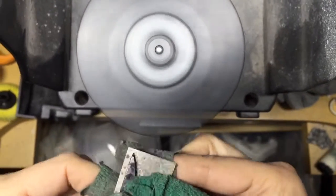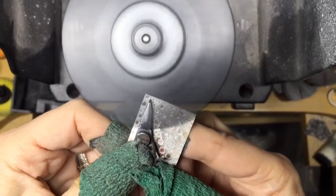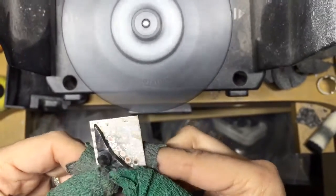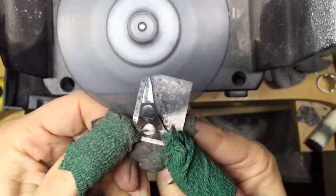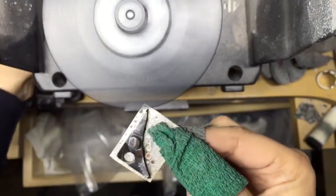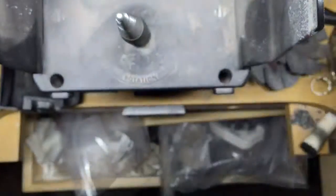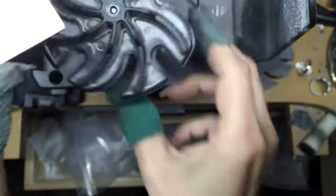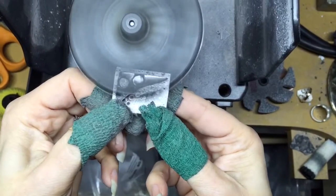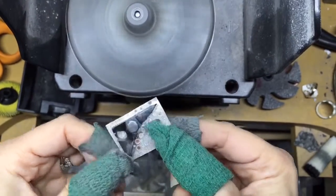It got very hard — whatever you did to it became very hard. The medial rise. We certainly heated it. From here, we cleaned up the medial rise, and then I'll clean it with the Scotch-Brite Unitized wheel. This just takes off the rough scratches and gives a nice smooth finish.